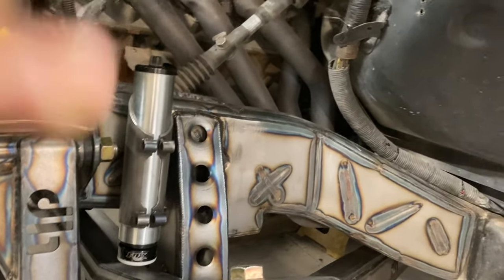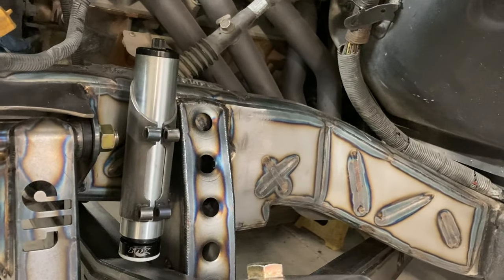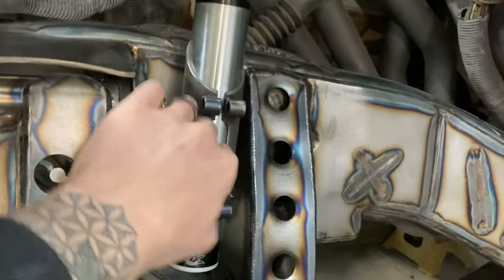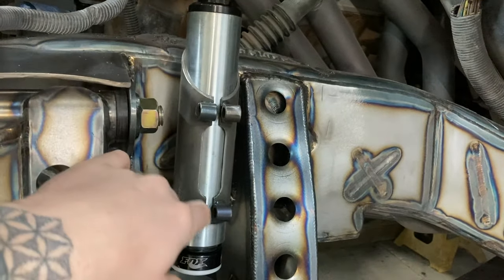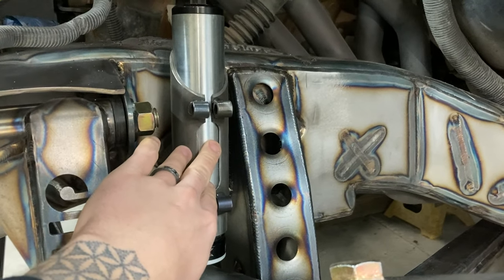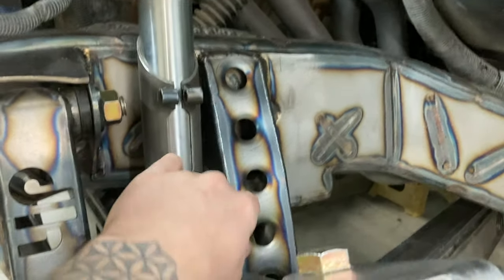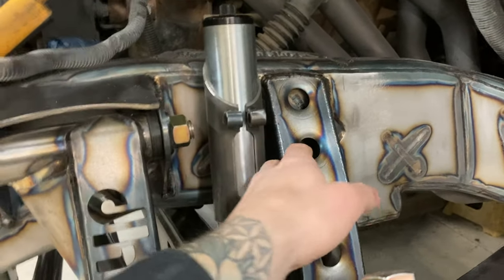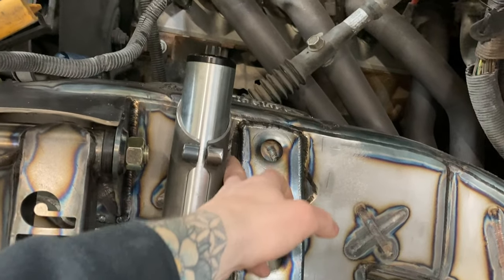Anyway, I've been working on welding some stuff up on this here. I ended up welding this beam pivot and this swinger just on this side, finished welds. I got some first passes on some other stuff on the other sides. The main reason I did that is because I had to pull this bump stop back off, and to be able to put this on and weld it on, this stuff needed to be finished, because I'm going to start plating in here, and I wasn't going to be able to weld this beam pivot back in there.